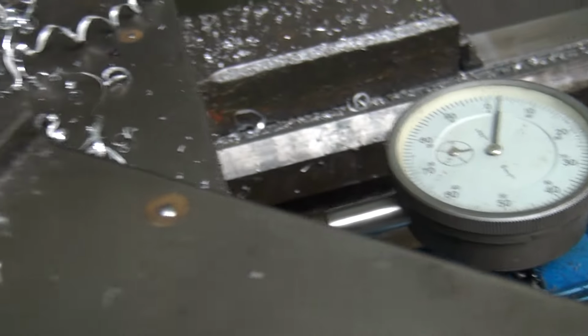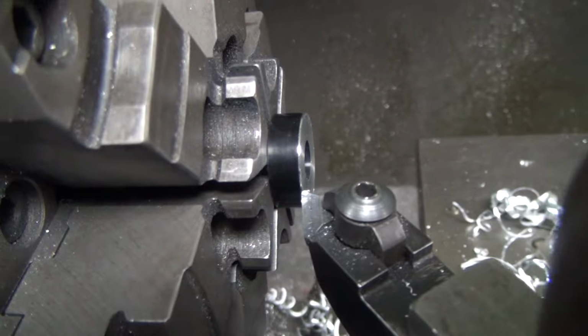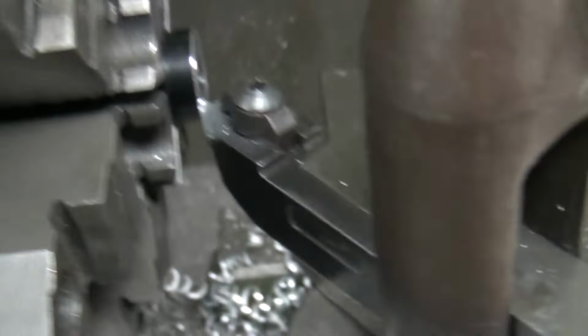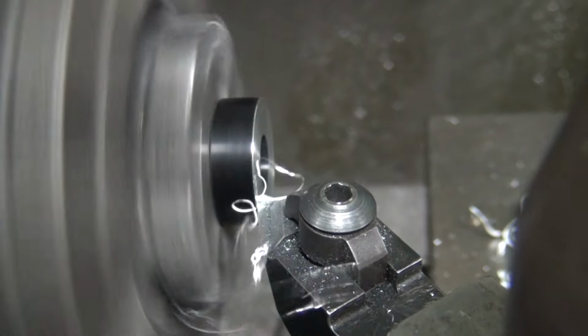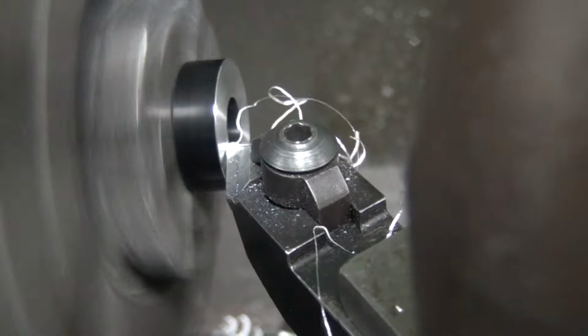15. So we got a couple thou to go. I already put the chamfer mark up on there. It's got a little shiny spot on the edge right there. Good. Line up a cylinder. All right, so we have 2 thou to go. We're going to give it 2. Turn the chuck on. We're going to cut it nice and slow. We'll have this little shiny edge right there, which we do. That's a little chamfer. You don't cut yourself. Keep it relatively slow.